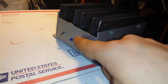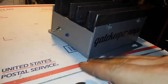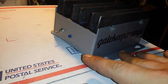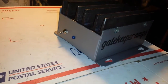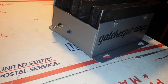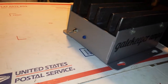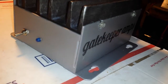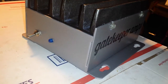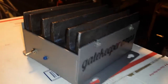The reason you don't see a variable or a high-low switch is because this front panel is actually part of the top or bottom portion of the case, so if you ever open it this has to come with it. I thought it'd be better to just do a high on/off switch and put a little bit of resistance on the input — because if you had a variable or high-low switch you'd have a lot more wires that had to come with it.